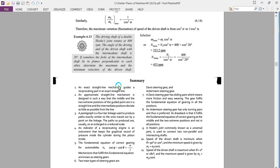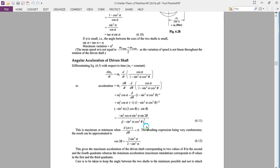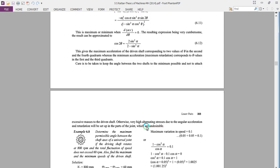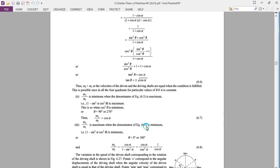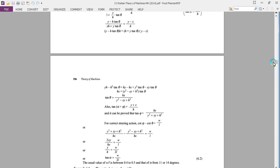Basically, you have to remember that the double Hooke's joint is used where the variation in the speed of the driven shaft is to be reduced. If that is not the condition, then simply we can use a single universal Hooke's joint. This completes our topic on the lower pair. You can contact me if you have any query. In this chapter there are only derivations and theory; numerical problems will come from this chapter. Thank you.